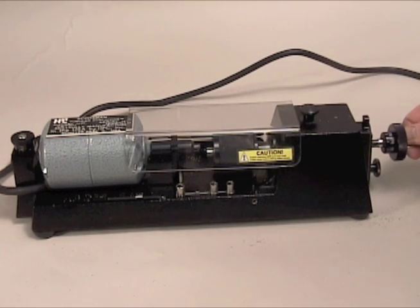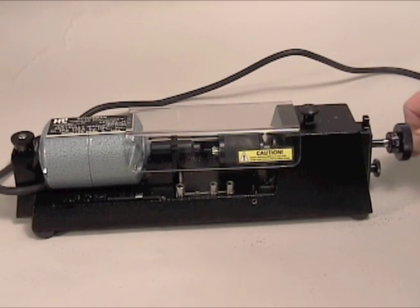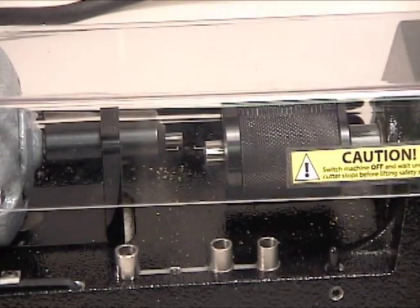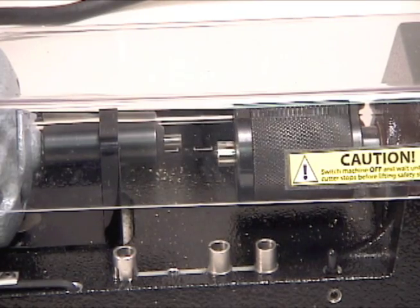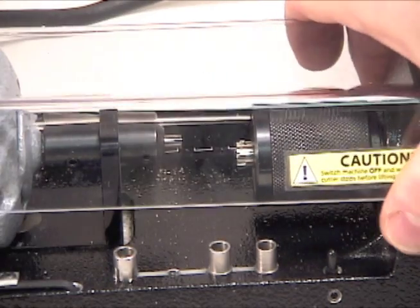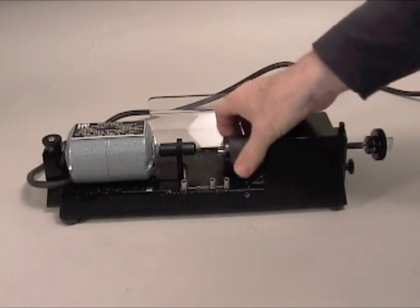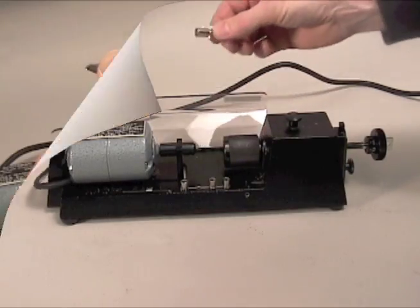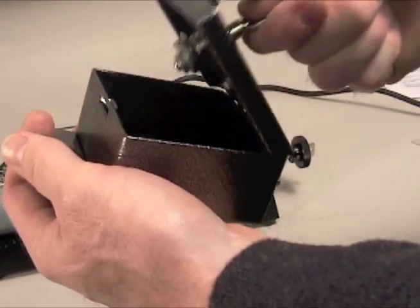Turn the depth knob to the depth for the second space. Turn the position knob to number 2 and push in until it stops. The second cut has now been made. Continue this process until all 7 cuts have been made. Switch off the machine. Raise the safety shield and loosen the collet. Remove the new key. Brush off any remaining brass chips before trying the key in the lock.